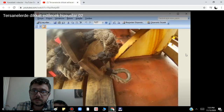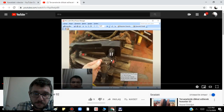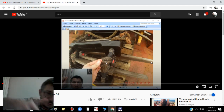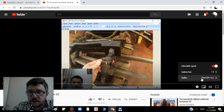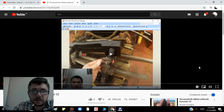I will show another photo also. I just try to break the fibrous with my fingers. If it is easily coming off, very easy to take, it is wasted. Or if you push too much with your finger and it is separating, it means the Manila rope is busted. But otherwise, it means you can still use this one — it will be no problem.